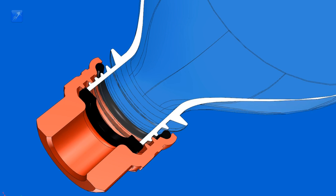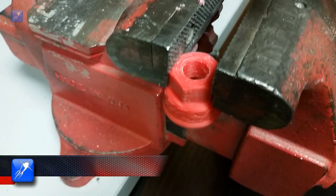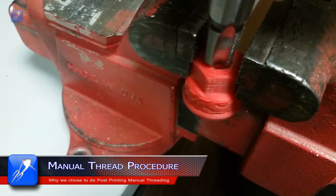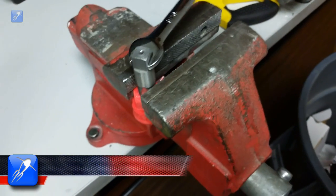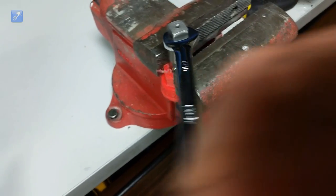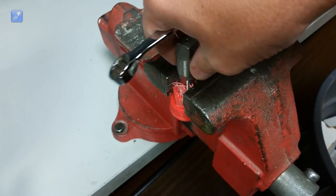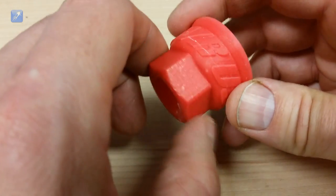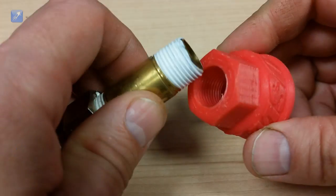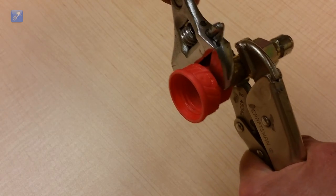On the opposite side of the adapter is a beefy hexagonal flange with a hole in it that is designed to accept a threaded 3/8 inch NPT pipe, once you manually thread the adapter with a pipe tap or carefully cut threads into it with a metal pipe fitting. Most 3D printers cannot accurately print the fine detail of pipe threads, so we made a conscious decision to leave the threads off the fittings and add them in a separate step. Once threaded, you can attach any pipe fittings you prefer and you can be confident these fittings will not leak.